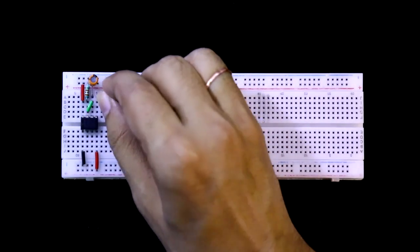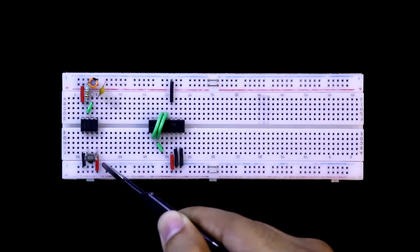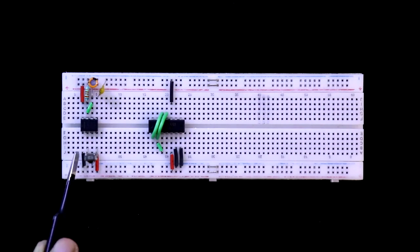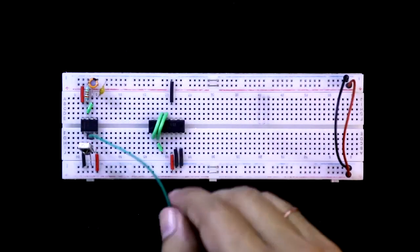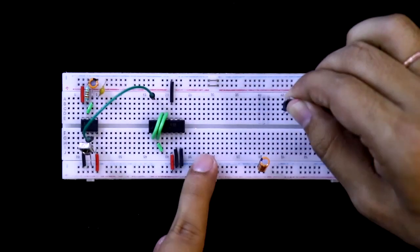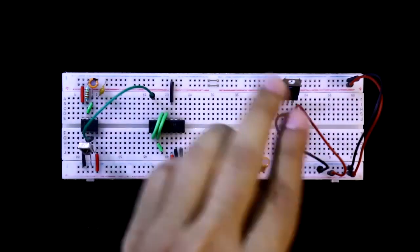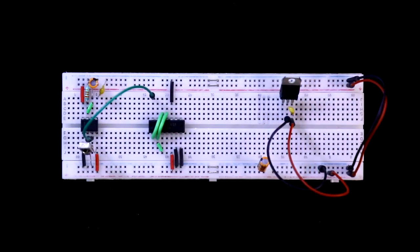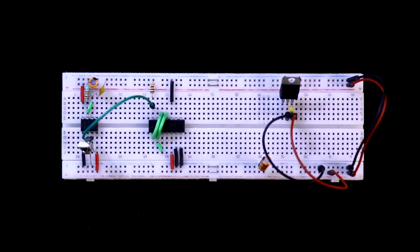With pin number 5, a 0.01μF capacitor is connected to ground. I have connected pin number 3 of the T-SOP to pin number 4, which goes to the positive rail. The middle pin, pin number 2, is connected to the negative rail, and pin number 1 is connected to pin number 2 of the 555. Pin number 14 connects with a 1kΩ resistor to ground. A 22μF capacitor is added on the plus 5V rail. The 7805 ground connects to ground rail, pin number 3 to the positive rail, and a 0.01μF capacitor between pins 2 and 3. Pin number 1 of the 7805 connects to 12V.